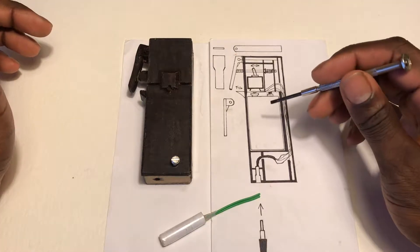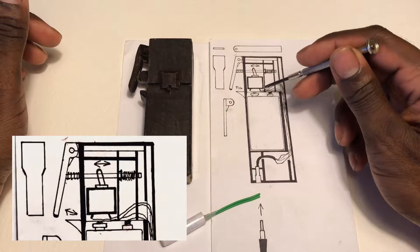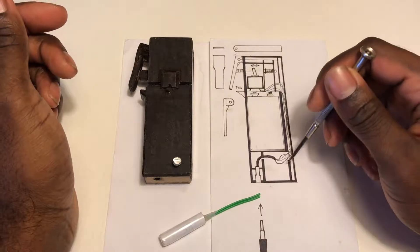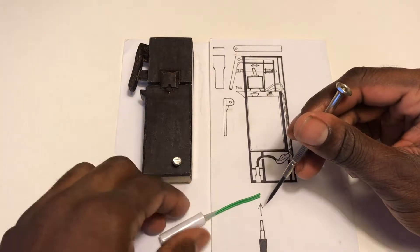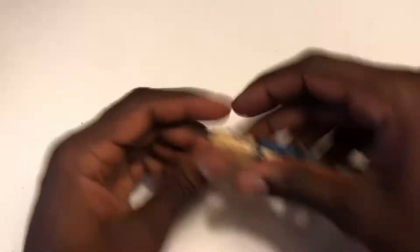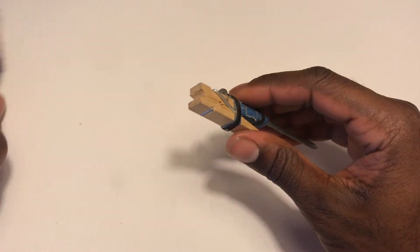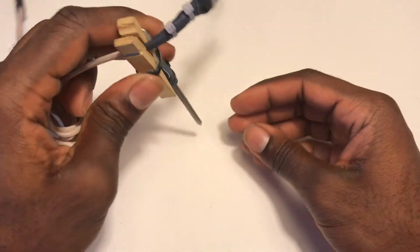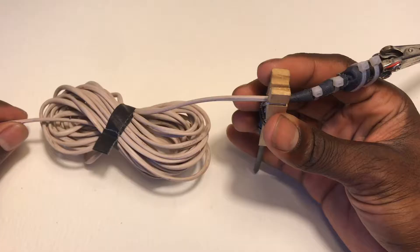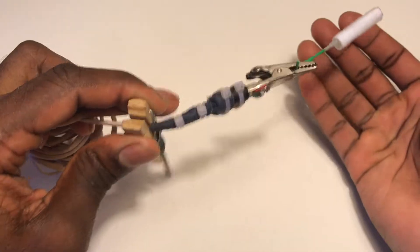So let's talk about how this works. There's a nine-volt battery which is sending current through this on and off switch. Once it passes through the switch by pulling the trigger, the current then flows through the cord, out the headphone jack, and into the electronic firecracker. This non-vital piece essentially connects around the wire so I can stake this in the ground, and while I'm pulling out the wire to where I'm standing to stay safe, it doesn't pull this closer and closer. So essentially this is just an anchor point.